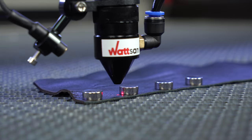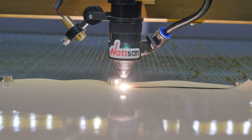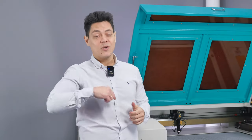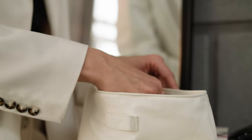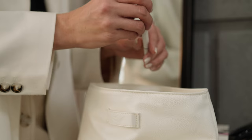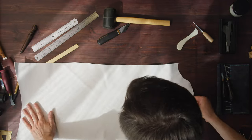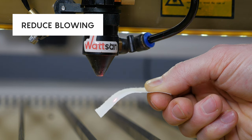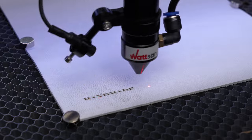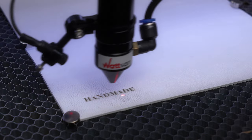This is convenient as the nozzle does not touch the material during the operation. Now let's move to engraving. How do you engrave leather on a CO2 laser machine without carbon deposits? One of our customers makes bags from white leather and shared tips and tricks with us. The main task when engraving white leather is to reduce blowing so that burnt particles of the material do not stick on the product.